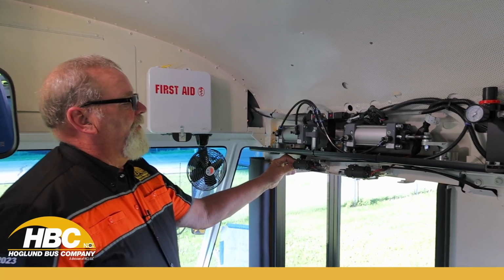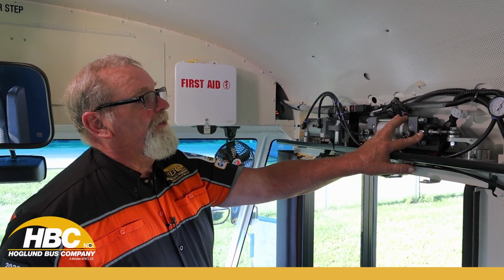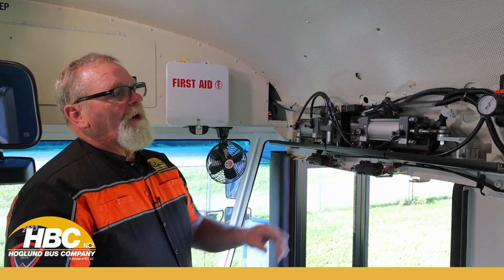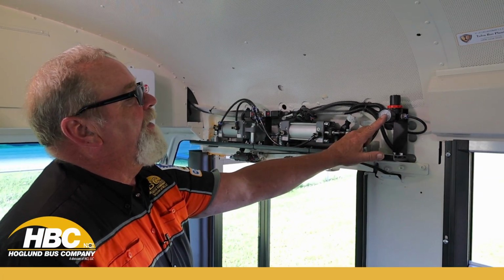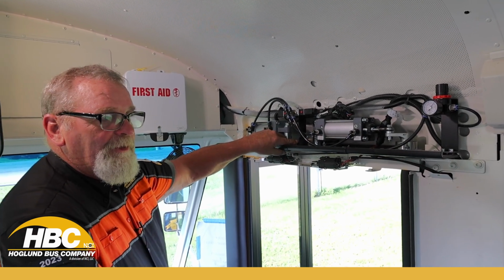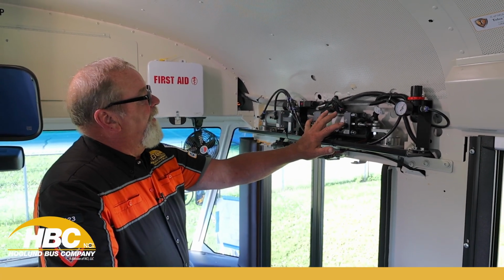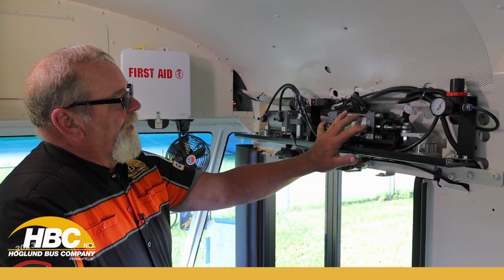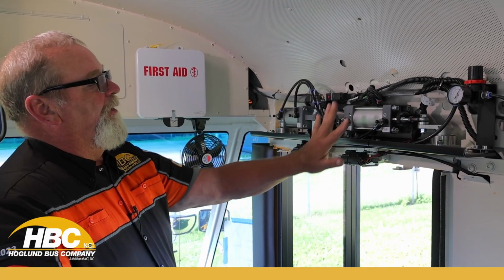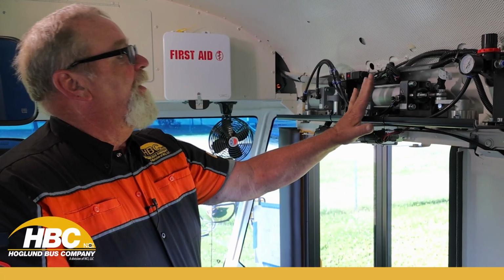The main thing we want to do is make sure that our strikers are hitting the micro switches. We want our door stops set so that they're hitting the cylinder and not our door frame. We want our air to be adjusted to 90 psi, and we want our set screws to be about 2.5 turns out. If you don't understand what's going on with the open and close speed, again, turn them in, and the starting point is always 2.5 turns.